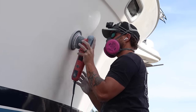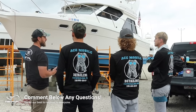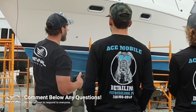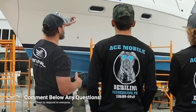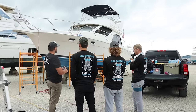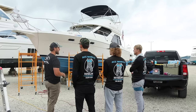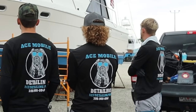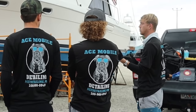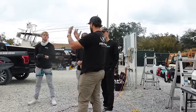At this point the entire structure is sanded besides the very front brow. We're only doing a 1000 grit dry sand. The reason I'm not going lower — we did do 800 and 1000 on the hull — but on the top side, it was so dry that in order to prevent ripping the rest of the gel coat off, we just did a nice 1000 to even out the oxidation. And we're buffing it and it's coming out really nice.